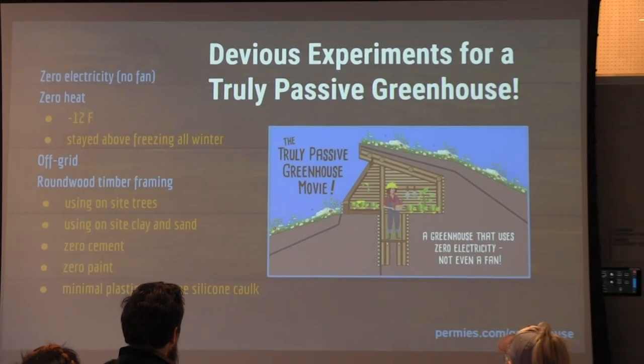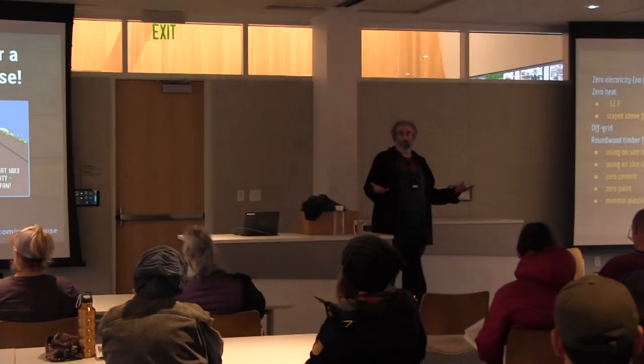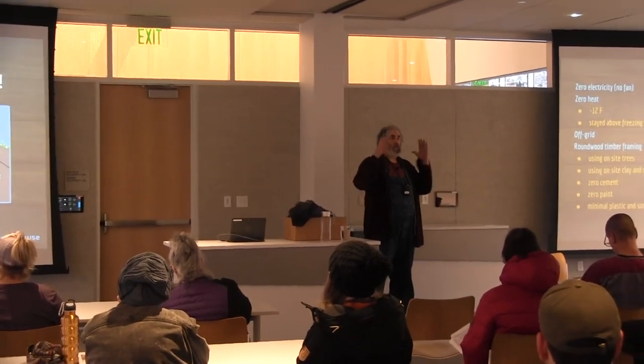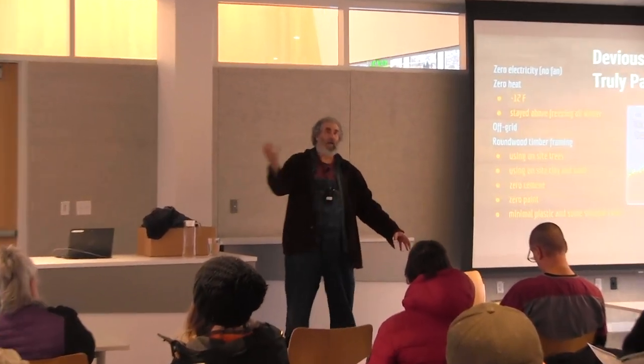So basically what they're trying to say is that they've got a geothermal greenhouse, a non-passive greenhouse. They have a giant tube that goes into the ground and then comes back, and they blow air in on one side, maybe suck air out of the other side. Because of that, all of the warm air that might be here right now goes down into the ground. And then 6 months later, they're going to bring that warm air back. So that's not passive. The giant fan makes it not passive.